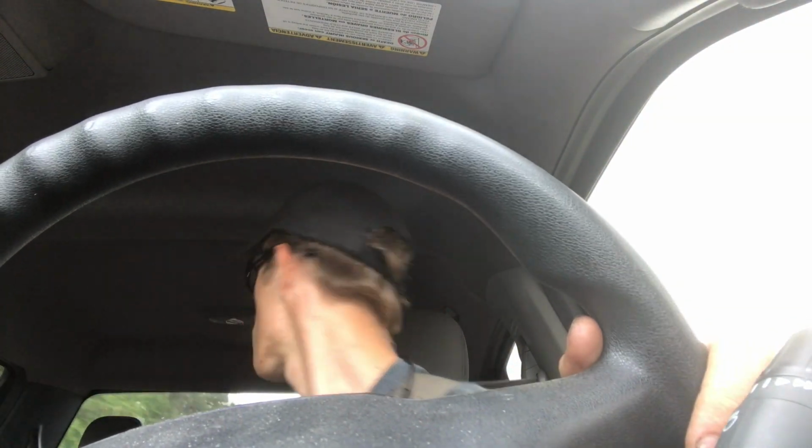Sorry, I'm trying to drive and talk and do all this. Not my best idea, but 7018 up on it. Did do a 6010 root on some of it because it was a gap that I could not get out to save my life. So we had to make it work. Got told off, somebody MIG welded it is basically what happened. Short circuit. I just put it that way, and it was all positive. They didn't know what they were doing, but hey, I can't say too much about that.